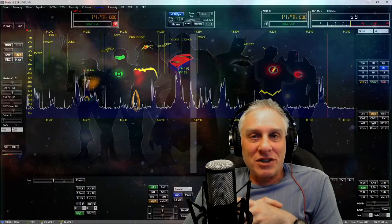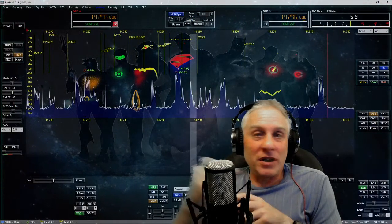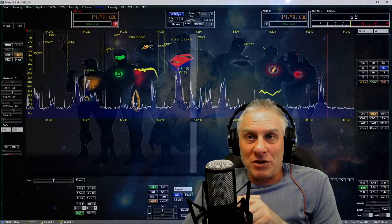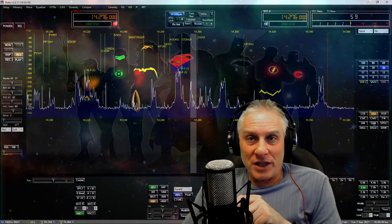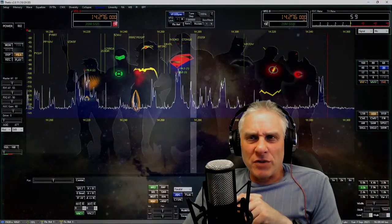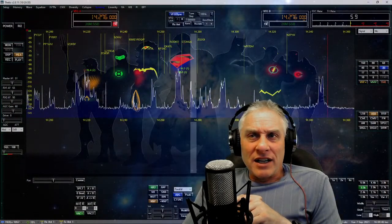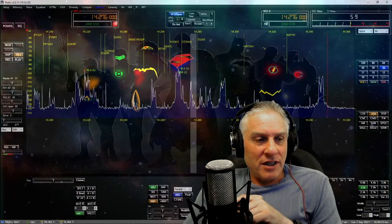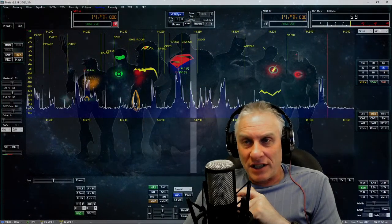The cobweb's interesting. It's all built. It's out on the end of the house. Two problems I had with the cobweb. The matching transformer, I know that's the issue. That's the big issue. It's all messed up. I was using the wrong core. I got some 43 mix cores here, I think. That came a couple weeks ago, and I've yet to get going on that project.